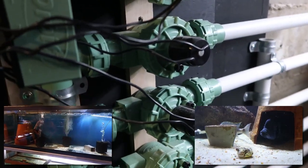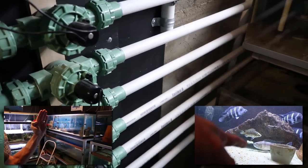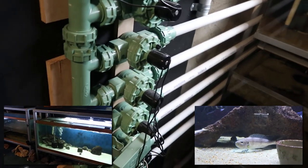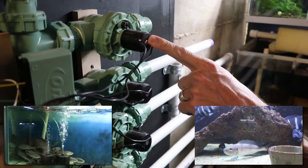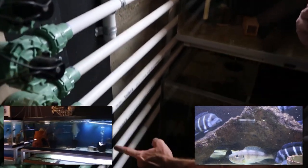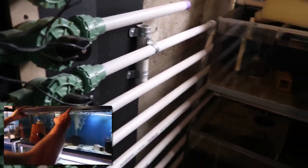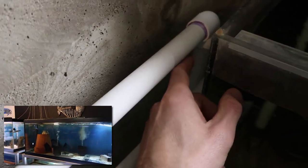The biggest challenge in designing the fish room was diagramming how all the zones were going to route to specific tanks. If you need to get a line two walls away, you might be crossing a lot of other pipes in a tight space. Jesse spent a lot of time drawing this out — figuring out which pipe takes the first turn, because the runs go down, across, and back up, and you can't block other zones.